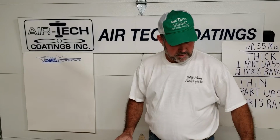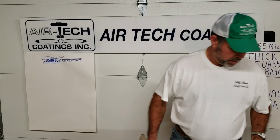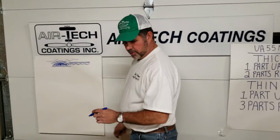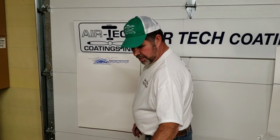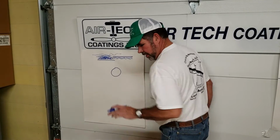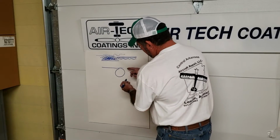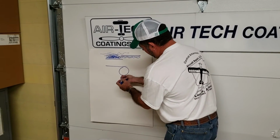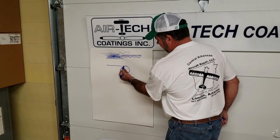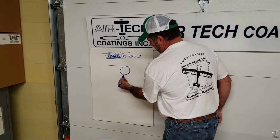I've got the rudder, kind of the perimeter, glued down around the edges. And before I start going around, let's go back to the Charlie Brown scribbling over here and show you what's going to happen. Whether it's the big side or the end on an elevator, let's just say this is a side view of this trailing edge right here. And our fabric is laying across this and just barely glued on. We're going to pull this around because you don't want the fabric to come to here and the other one to come to here. I like for fabric, and the proper way is, to wrap all the way around.